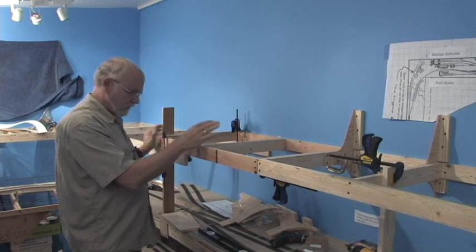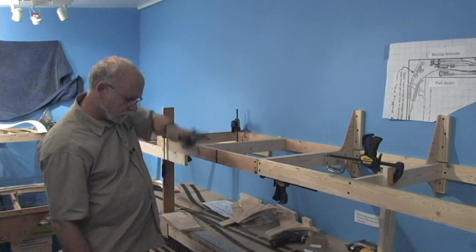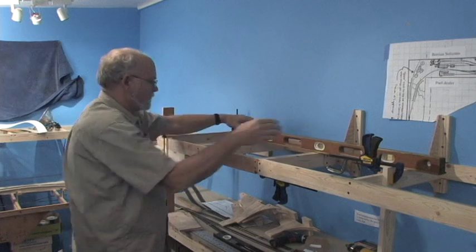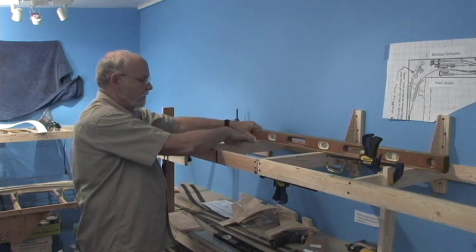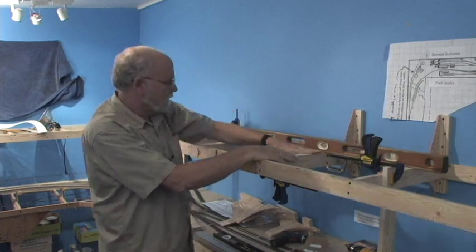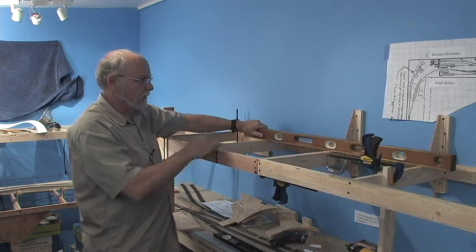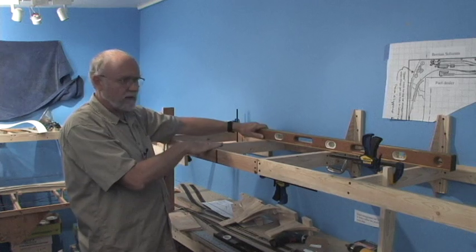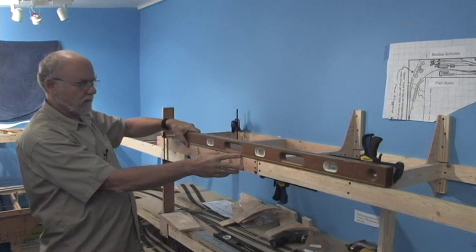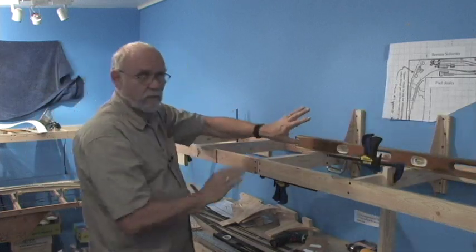While clamping everything into place we've checked the level on the back side — that looks good. We've also used the big level to verify alignment between the cross pieces where the two sections of benchwork join, making sure everything is going to be nice and smooth so two separate pieces of plywood up here form one smooth level surface. Likewise we check the front side to make sure that's all nice and smooth and level. Never hurts to check these things more than once.